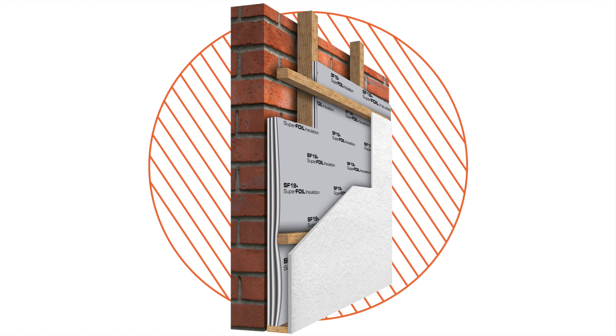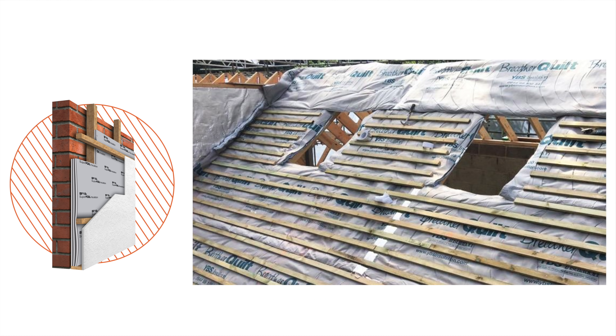The second option is a multi-layer foil. For this I'd need 38mm square battens attached to the wall vertically, then staple the multi-layer foil to the battens using aluminium tape on the joins, then cross-batten with more 38mm square timber and then plasterboard. The battens function to allow the foil to fill up the space and create a gap to allow heat to be radiated back towards the room. Supposedly it has a very good U-value but I'd lose 100mm of floor space. I would also be a bit concerned if any condensation does occur behind the wall as the battens may not fare well. As an aside, multi-layer foil looks really interesting but I'm struggling to find use cases other than pitched roofs where you'd have battens anyway for your roof tiles — but definitely worth being aware of.